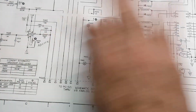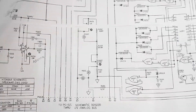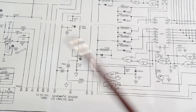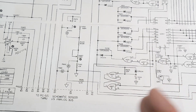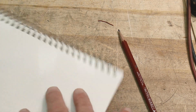The magic is one chip, but you also need a very good analog-to-digital converter and good digital filtering. You couldn't really buy an A-to-D that could handle this job back then. Most five-and-a-half to six-and-a-half digit voltmeters operate on a principle called a dual slope integrator, so let's talk about that.